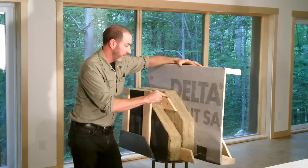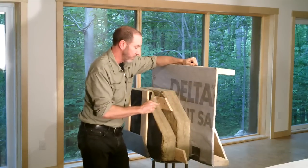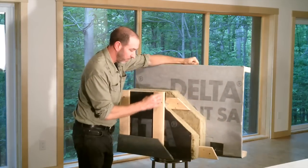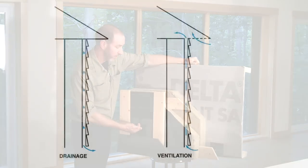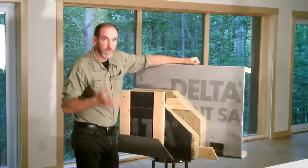We've got eight inches of insulation, but it's broken up in two courses. We attached the first four inches with one set of strapping running horizontal, so the additional four inches can get attached vertically. That leaves a drainage plane and air space in the interior to let water drain out and moisture rise and leave. The natural air convection will have cool air coming in at the bottom — as long as it can leave at the top, that gives your walls the ability to dry out.